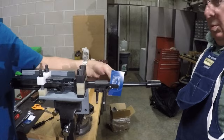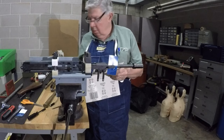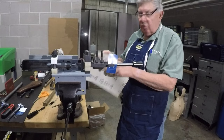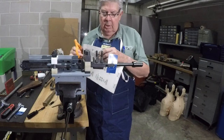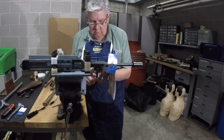Okay. What are you using there, Chuck? That's just sandpaper? It's emery. Richardson also recommended this. You put the emery against the inside of the wrench. It gives it a grip, and you put the smooth side against the barrel. So when you tighten it down, it protects the barrel from metal-to-metal contact, so that if it slips, you're not scratching the barrel. So you just cut a piece that'll fit right within that. Trying not to be wasteful here. Just standard 150 grit emery paper.